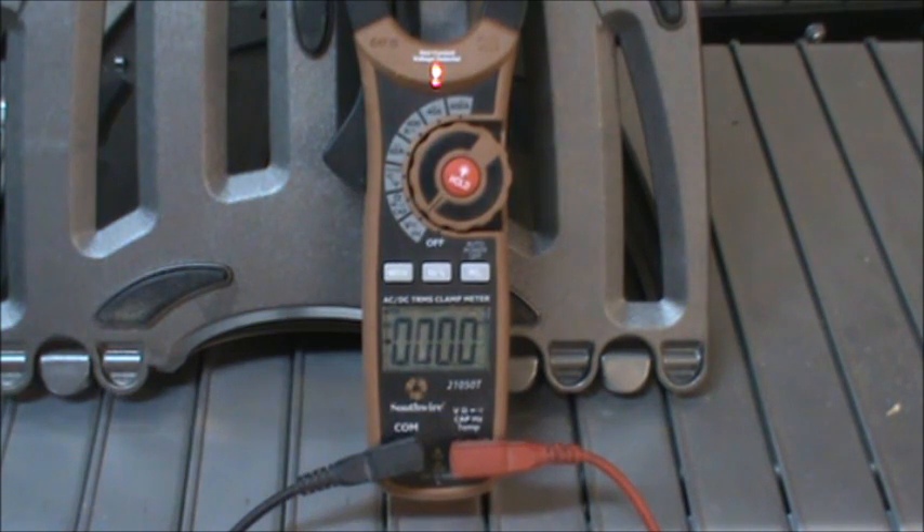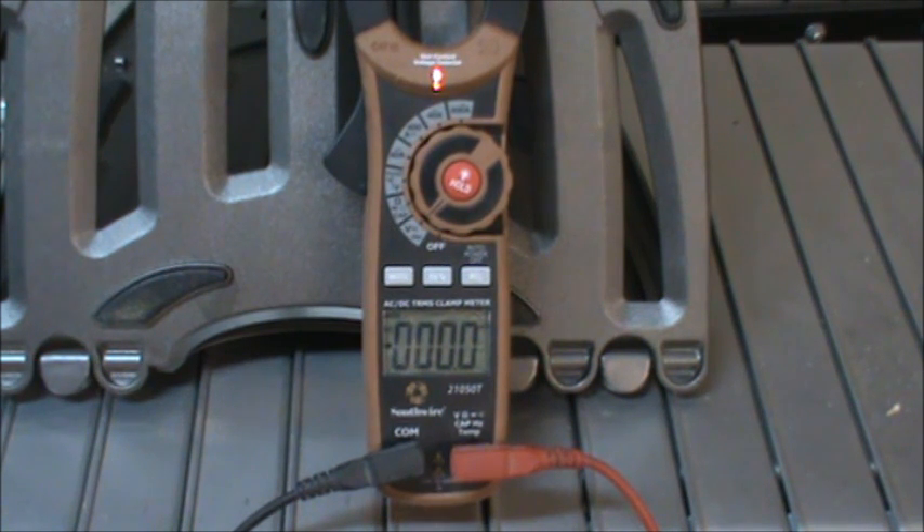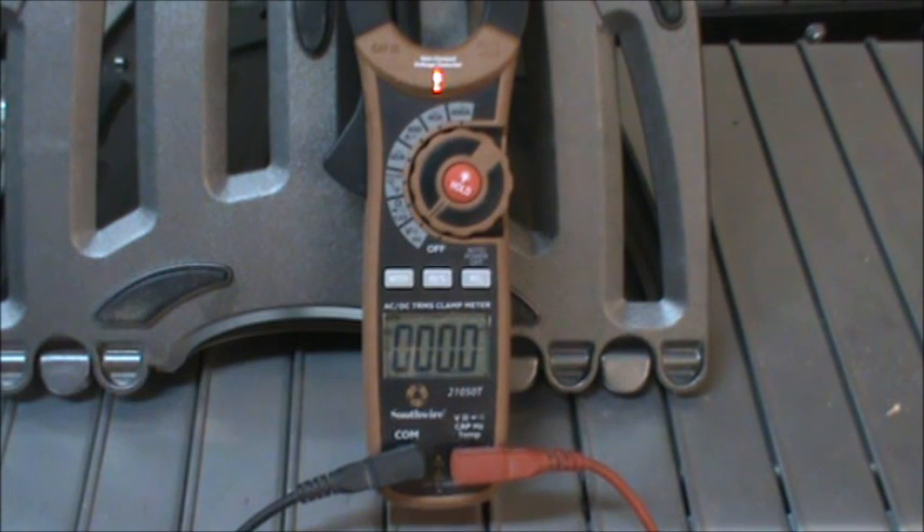After the five-day rest period, the voltage had crept up to around 3.109 volts — well over three-tenths of a volt higher than expected. Not only was the resting voltage much higher than I wanted, but the cells were bouncing nearly four-tenths of a volt. So after some thought I decided to change the programming on my relay.